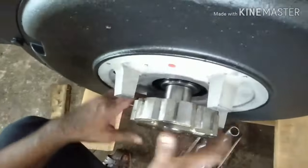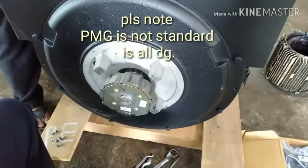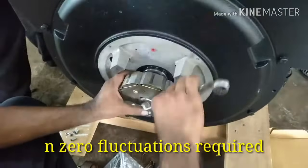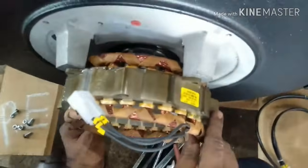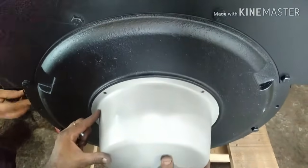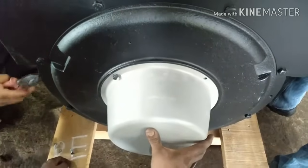Here you can see a skilled technician installing a PMG on the ND side — non-driven side — of an alternator. This is a very skilled job as the rotor magnets are very powerful, and they tend to pull the stator winding towards them. So this is a very delicate job and has to be done only by a practiced technician. Friends, I hope you understood the topic and the whole purpose of using PMG in our alternators. If you liked the video please leave a comment below. Thanks for watching, have a good day.